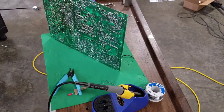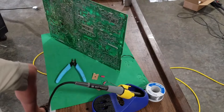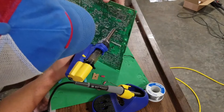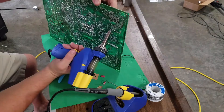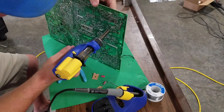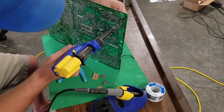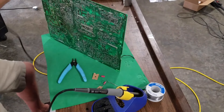We're going to dive right in and go with the next capacitor. I've got my finger on it and I find the two points on the back end of the capacitor, then I'll put the edge of this removal gun on it. It starts to get hot and then it just clears it out — gets rid of all that old solder real easily. You can even pull back on it while it's doing that and it safely pulls the capacitor right out.